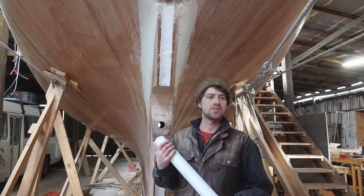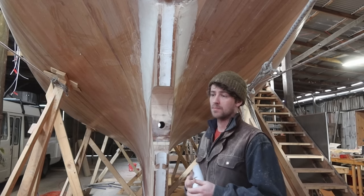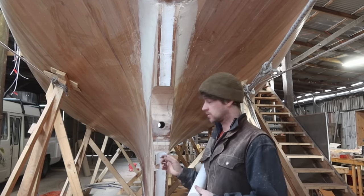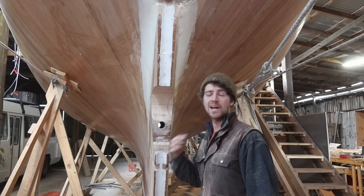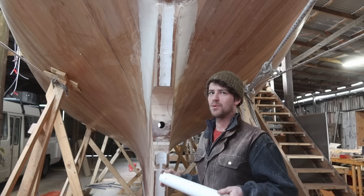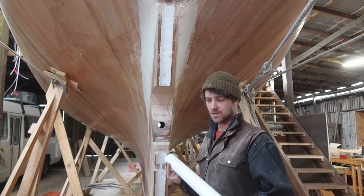So the rudder is sort of complete. We're now looking at the sternpost face and making castings. So a lot of pattern making for all the gudgeon and pintles on the rudder. We've notched out and dry fitted quite a lot of them to make sure they work before they go cast and then come back and they're the wrong size and we'll be in trouble. It's quite labour intensive making patterns for castings for bronze, but Ifra has been working hard.